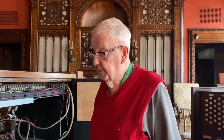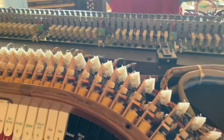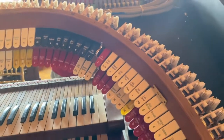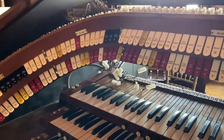This one will be laid out for recording purposes so you can actually play, go out and listen to what you played, and if you don't like it, you come back, erase it, and do something else. This console here will do the same thing when it's finally up and running. They're about as versatile as we can make them with today's technology. Each tablet has got five wires going to it — sense wires, on, off, plus and minus — so all those have had to be restored and renewed. Everything's been apart, reassembled, and spaced to the specification that this organ will play at.